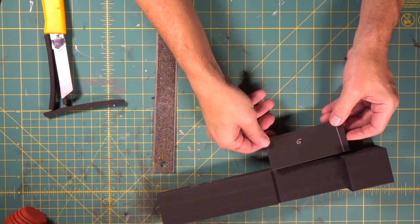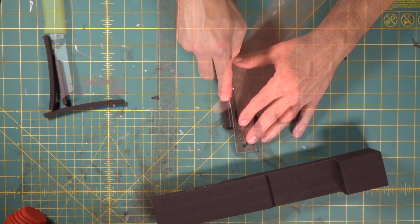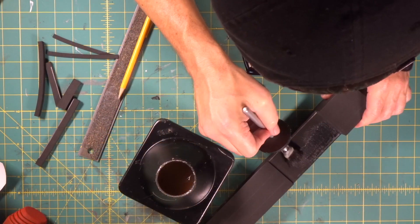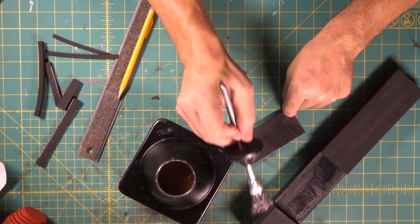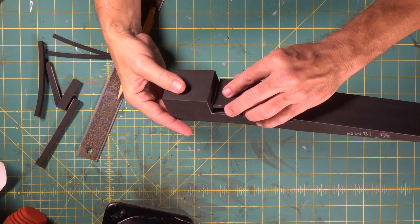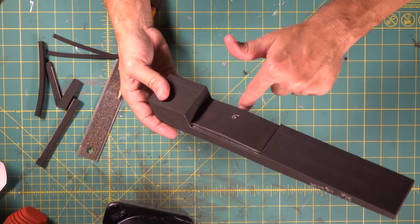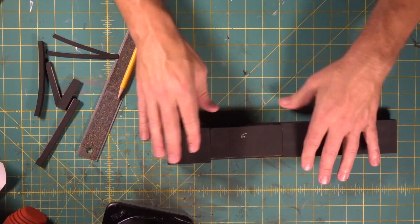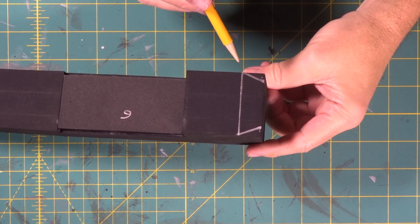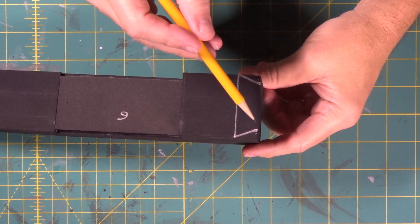Now we can make sure that our length is proper — that's our new adjusted mark and cut through. Perfectly flush right there. Let's get this end down first so we know we're perfectly centered. We're flush up against here and we're centered here and here, so now we can push the middle down. Now we transferred our pattern over because the back end of this central body piece needs to taper in right here, so we're going to make these two cuts on the band saw.